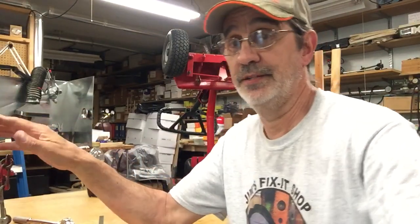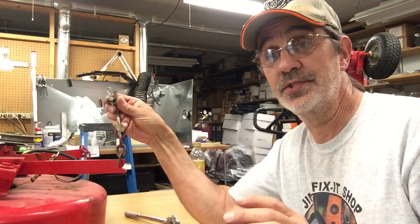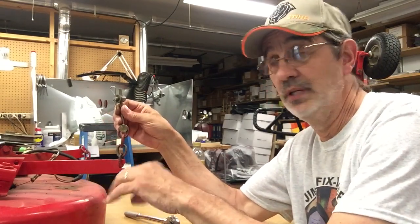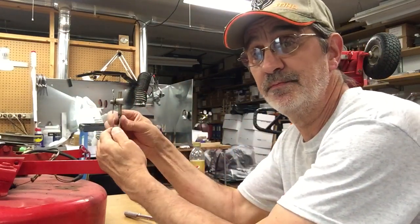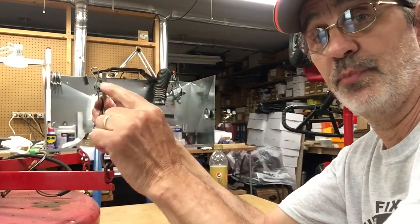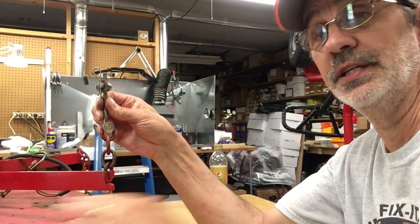Now to level the back of your deck, you have to bring that back up to make it the same as the front. That is done with these chains, if your deck has chains — some do not. To adjust the back, you can either put something under the back of the deck and get it level. Then all you have to do is pull this hairpin out, pull this little bracket out of the arm on your machine, and screw that down until it lines up with a hole if you've leveled your deck. Otherwise it's just going to be trial and error until you get this thing level.